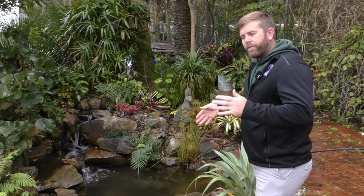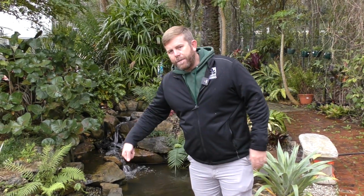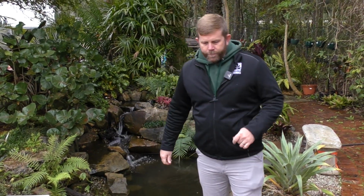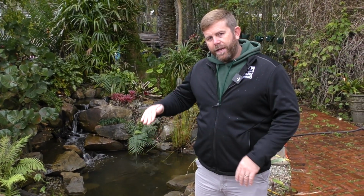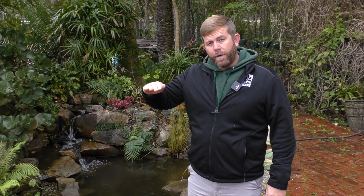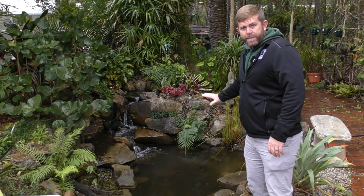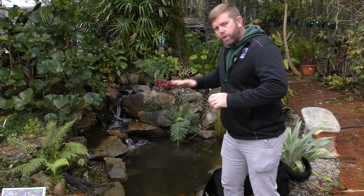All right, so this is where we're getting to the 48-hour mark. That next day, day number 3, you're going to come out and check and measure that distance. That's going to tell you 2 different things, okay? If your pond was off and it held water to the very top of that overflow, that means you do not have a leak in the pond itself or a leak in the skimmer, most likely. Your pond is holding water.